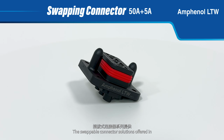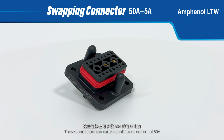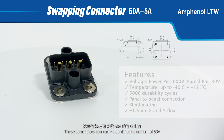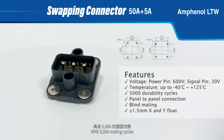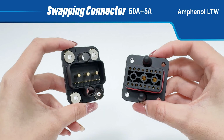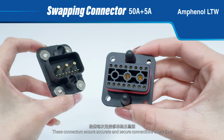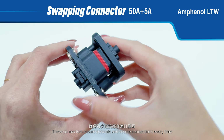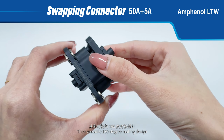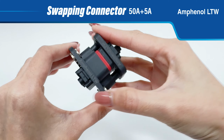The swappable connector solutions offered in 2 power and 8 signal configurations. These connectors can carry a continuous current of 50A with 5,000 mating cycles and IP67 rated in mated and unmated conditions. Equipped with a quick lock mechanism featuring blind mate design, these connectors ensure accurate and secure connections every time. Their versatile 180-degree mating design makes installation seamless and efficient.